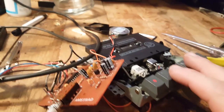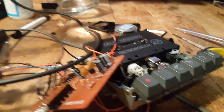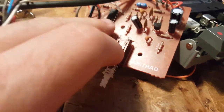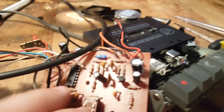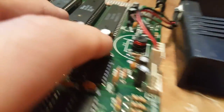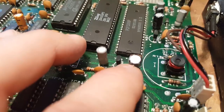I'm not too bothered — it would be nice to fix it. I've cleaned it and put some of the mechanics back; some switches weren't making contact properly at the back so I've cleaned those. Everything is working mechanically. I'm wondering if this operational amp has gone bad. I don't really have anything to diagnose that. I can't see any obviously bad caps, although this one has a slight bulge — hard to tell. This other one probably has a little bit of a bulge too, but nothing that really jumps out at me.